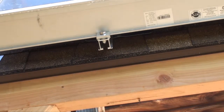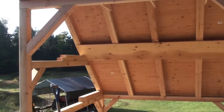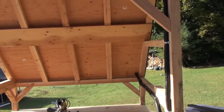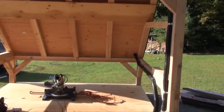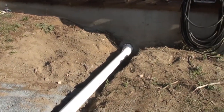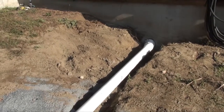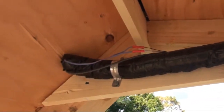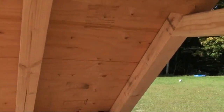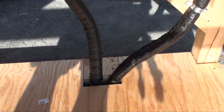The rails bolt to those, and the panels clip onto the rails. An added benefit of this framework is it gives me some more storage — I'm not sure yet if I'll use it for piling cord wood or enclose it for extra storage, since we don't have an attic. The supply and return lines are buried in this four-inch piping, coming in underneath the decking with a 90-degree elbow up through the framework, feeding into the top and bottom panels. It's a very simple design but it works great.